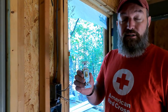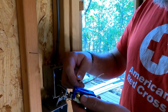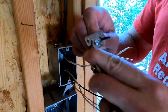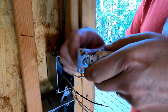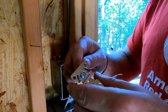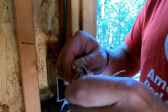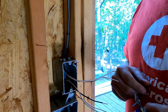Something I bet you didn't know — I didn't know either. We're going to use this light switch to strip this wire. So you measure out how far you need on the back, spin it around a couple of times, there you go. Spin that and then voila — stripped wire. This little hole right here, put it right in there, flip it around. There's your bend. Too easy.